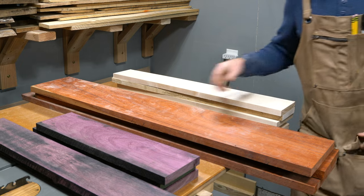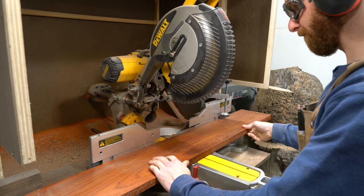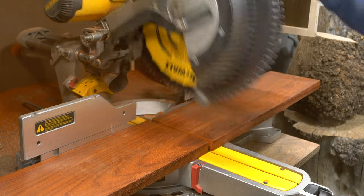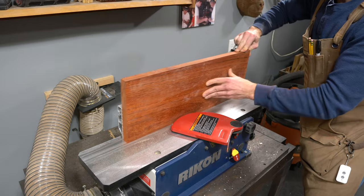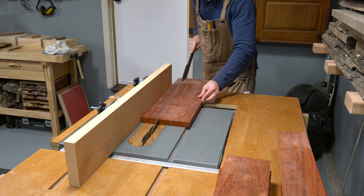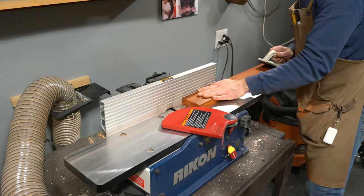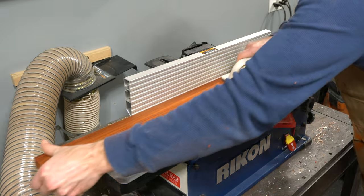The first crucial step in this process is to mill all the lumber to a flat, uniform thickness. I'll be using my miter saw to rough cut the length of the boards, which will make it much easier to flatten them later on. All the boards are far too wide to face joint, so I edge jointed them first so that I could take them over to the table saw and rip them all to a smaller width. Once all the boards were ripped to fit the capacity of my jointer, I then face jointed all the boards to flatten one side. The milling process is crucial to make a great chessboard, as the symmetry and uniformness of the checkered pattern is what makes a chessboard look so appealing.